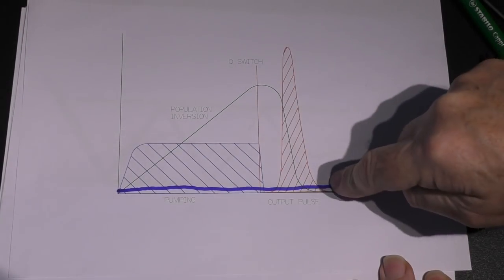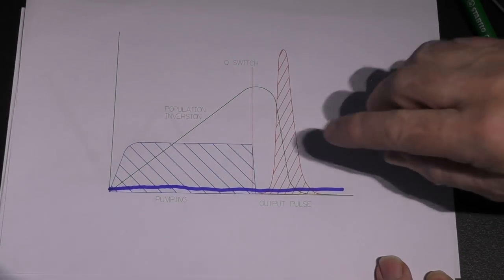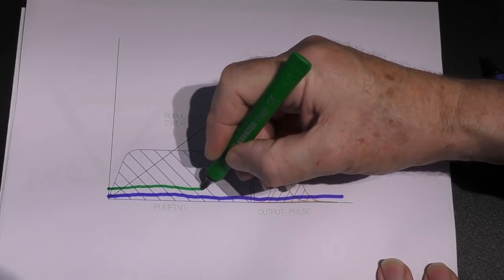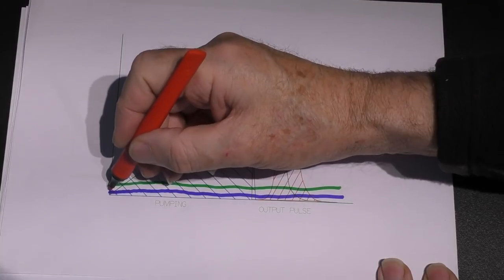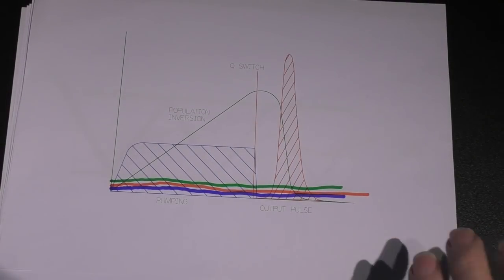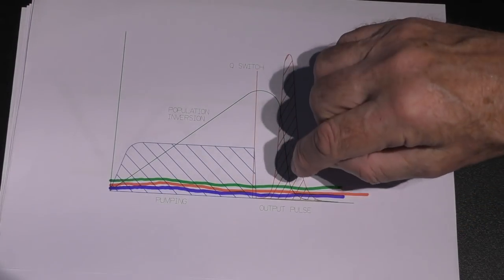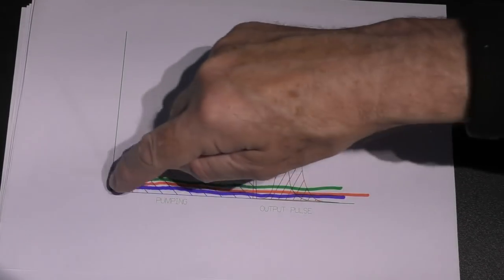In the case of a continuous output, we're also pumping but we've got a constant leakage, so we never reach saturation. What happens is we pump electrons up to a certain stable amount — let's call it that level — and it will be stable because as we pump electrons up to the higher level, they're leaking away, giving us our 20-watt output. To make this more understandable, imagine a bath: if the water running in is slightly greater than what goes out the plug hole, a balance is achieved — a certain level of water where it disappears down the plug hole at the same rate it comes in from the tap.